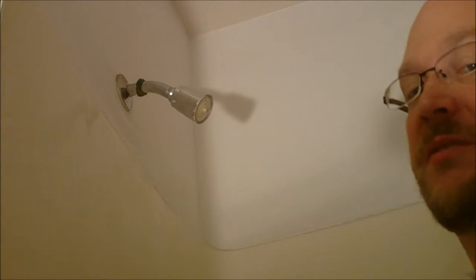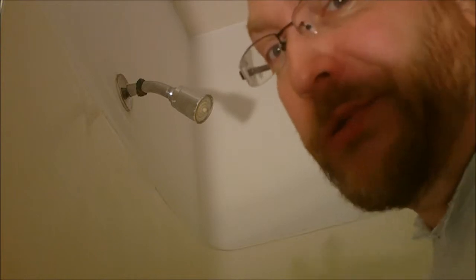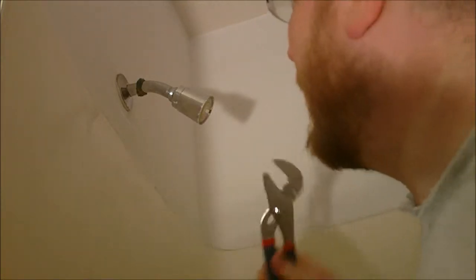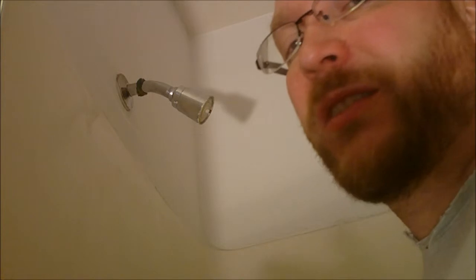I've told you it wouldn't take long, especially with the modern video. Ignore the nasty rubber band that holds our shower caddy up — keeps it from slipping down. Now, this round part where the threaded stem comes out — it's flat — and that's so you can get a wrench or pliers on it. You can use adjustable pliers to grab that and take it off. That works fine, but since they tend to have teeth, it's more likely to scratch it. So if you have an adjustable wrench, such as a crescent or the like, use this — it's just less likely to scratch things up.